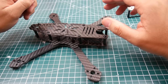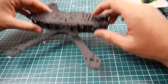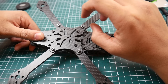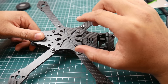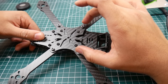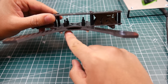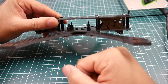Something I noticed that I kind of did not like — though it's not a deal breaker — is the fact that the arms are held with self-locking nuts, but not the type that are engraved into the frame and hold very well. There are two screws holding each arm, and you only have one nut to hold it firmly into place, which are these outer nuts here. The inner screws are being held by the nylon standoffs, which are acting as a nut in a way.